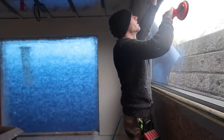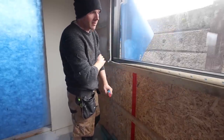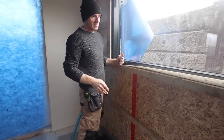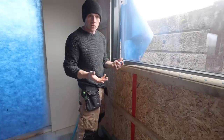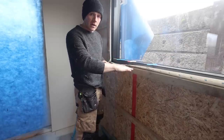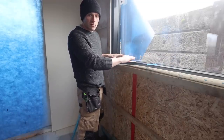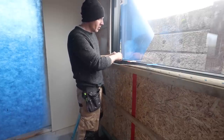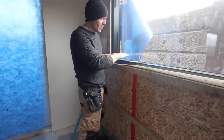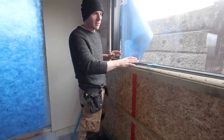Let's get a screw in here — safety screw. Now every window I've fitted in the past, I've checked my sill because we were in an old house last time. It would ordinarily be off a little bit. So I'd get my packers, set them out on the stonework or the brickwork, make sure that whatever was required was put down — a little blob of silicone to hold them in place. Then I know that if the window sits on those packers, it's exactly level and where it needs to be.